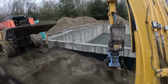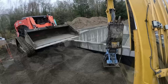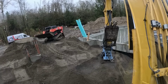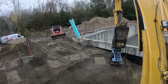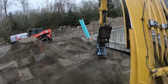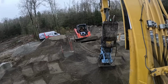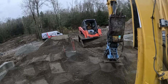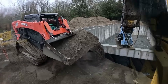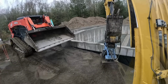It's back to the other lift as soon as you do that. I've been coming up and see he brings these little bits in, really only 8-inch lifts, which this compactor will do a foot no problem. It welds the dirt together. I swear to God, like that fluff in between the plate, you can't even rake it out. It's rock hard. It's insane how hard it gets. When we were doing the compaction test down at that commercial site, we were getting 105%. And that all goes on the right consistency too of moisture and everything else, and your material.